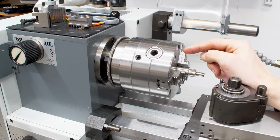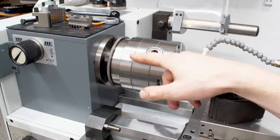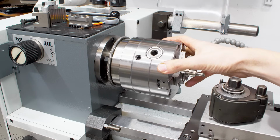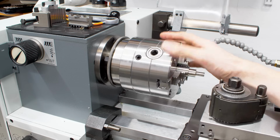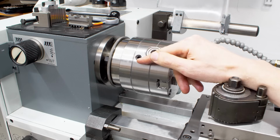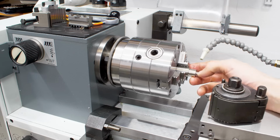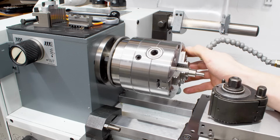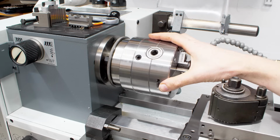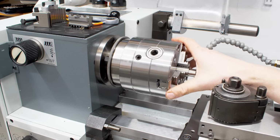So that's absolutely necessary. As it's an adjustable chuck, but when you run soft jaws, you do not really need the adjustment feature. But at the time, this was the only steel body chuck that I could get in the right size and in a reasonable time frame. So I figured the chuck with the fine adjust is a nice bonus if I have to use hard jaws in this chuck and want to adjust the run out of a part. I ordered a second back plate to go on the spindle nose of the machine. I will also put my 6-jaw chuck from the MCO on here again, but that's still on the MCO machine because I still use it.